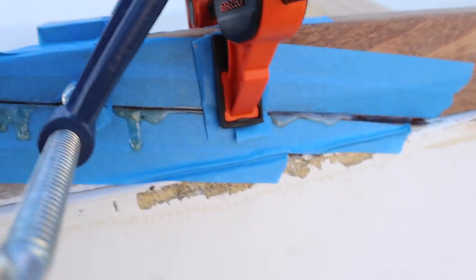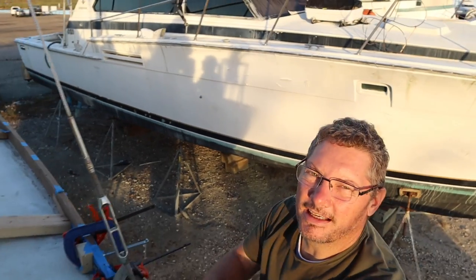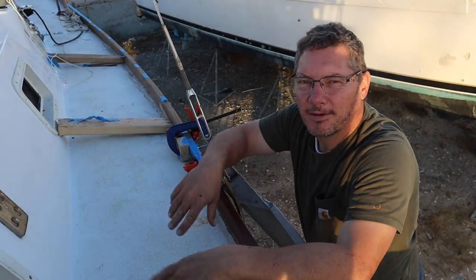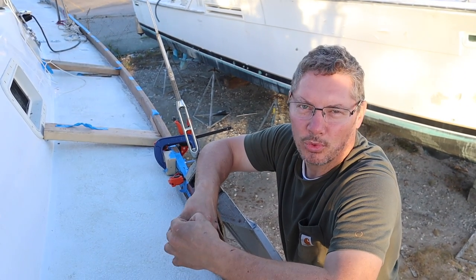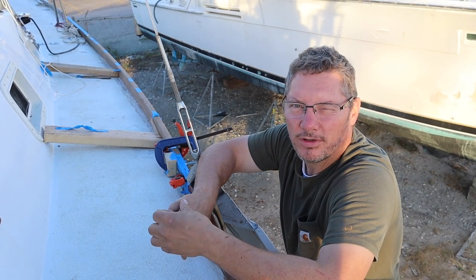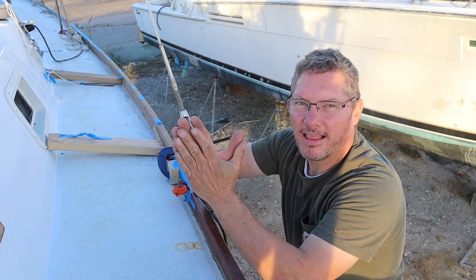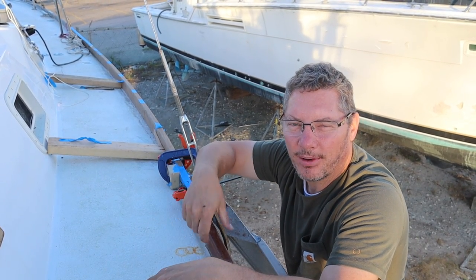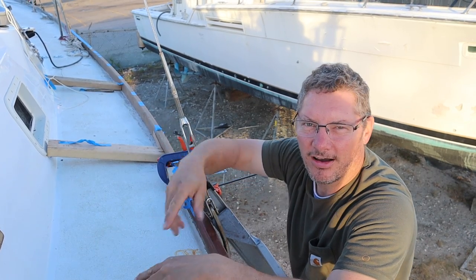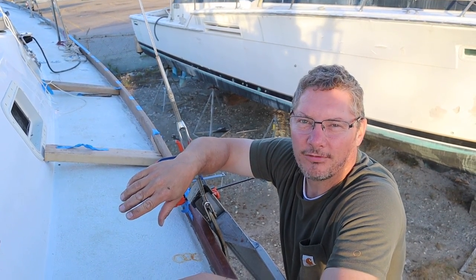You can see right in here — that's the joint. All the way down along that board I put tape along that edge so that epoxy that spills over isn't going to be all over the wood, just on that little sliver that's exposed. I did the same thing with the clamps — put tape on the ends so that smooshed epoxy won't glue my clamp to the teak. The tape will stay on, the clamp will come off, and what doesn't peel I can sand off with the sander.